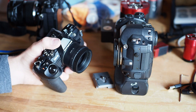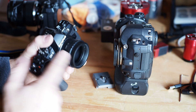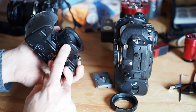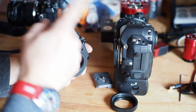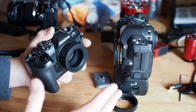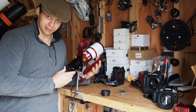And there are lots of other options out there. Another thing to note: the M42 system — you can loosen these Allen screws all the way around here, which will actually allow you to rotate the clock position of the threads. That way, when you put your camera onto your telescope, you can get it oriented however you want. That was just something that came by nature because it's a thread type lens mount.